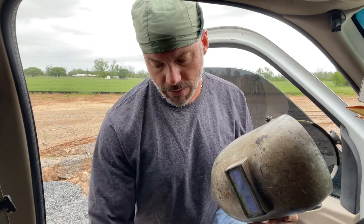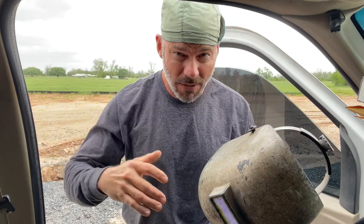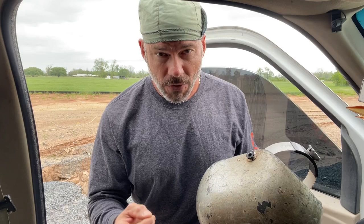About shade 10 - that covers everything, and if you want something different use something different. Now let's move on to this hood. The only reason I carry this hood is I prefer pancake 99% of the time, especially if the sun's out. That pancake fits like a mask and it doesn't let the sun get behind you, because if you can't see you're pretty much screwed welding.